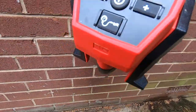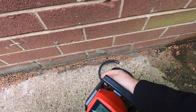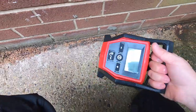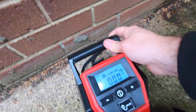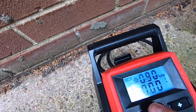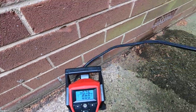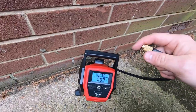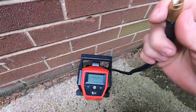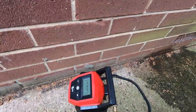So while that boiler's testing, I'll show you around this Milwaukee M12 compressor. It takes the M12 batteries, of which I have a lot. That's the smaller battery on this one. What this does is just replace any hand pump that you might have. Nice and compact design, decent handle — you can carry it with your toolbox at the same time. Power on. You can set to bar or PSI and charge up to whichever setting you like. Generally, expansion vessels are around 0.9 to 1 bar, somewhere around there. Press pump — that's going to pump it up. Obviously power to set it back off again. Not fitting all your expansion vessels, you can get an adapter for it as well if that's what you need. Great bit of kit, nice and compact.